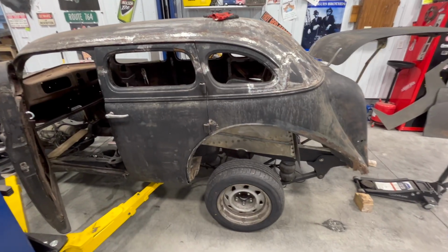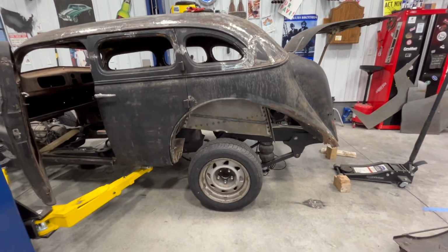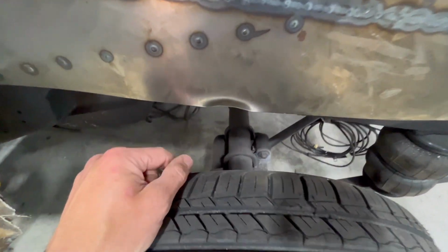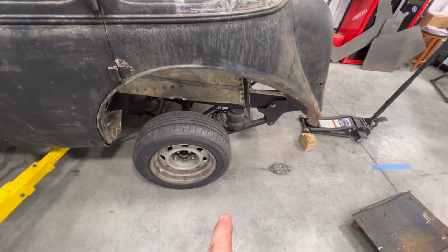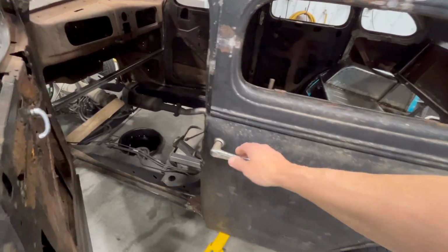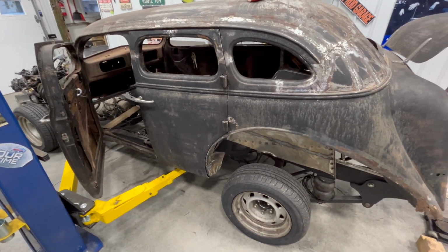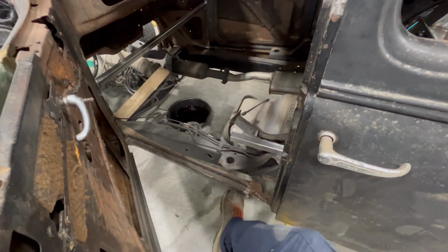All right, so this looks pretty dumb, kind of like a gasser moon buggy kind of goofy looking thing, but I did find this out. Where my trailer fender goes through, where my inner fender well is made, I've got to notch this a little bit because it was bumping onto the top of the axle when the airbags are all the way down. But when I did jack it up like this, with the airbags all the way extended, what I found was, hey, magic, rear doors close.